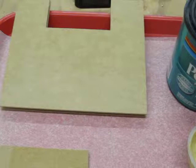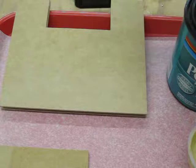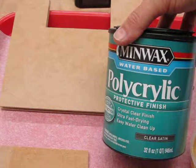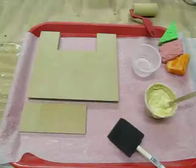These walls are quarter-inch MDF and they're quite smooth. If you're working on a plywood that has a grain, you may need to do a preliminary filling with the full-consistency Elmer's and a palette knife to get rid of any grain, let it dry, and sand it before you apply the finish. The clear finish on this is poly acrylic — it doesn't have to be Minwax brand, but it needs to be a water-based poly acrylic. Better if it's a satin, as it will have a texture that provides better adhesion with the filler.